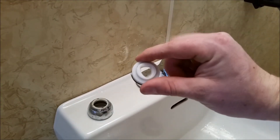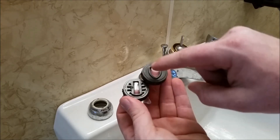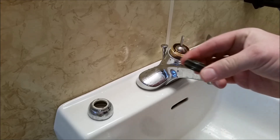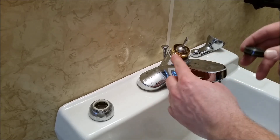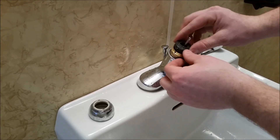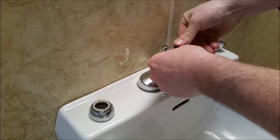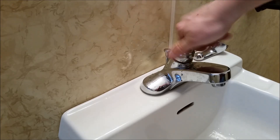So we're going to look at our old cover. You're going to see that this one is the triangle or V-shaped one — there's also a rectangle one. We're going to use the V-shaped one because that's what we had in there. You'll notice it has a little notch on the side here that's going to go in the notch of the faucet on the left, hot side. We'll just push that in, make sure the O-ring seats in there nice and well, push it in until it's all the way flush. Then we'll go ahead and grab the chrome cover and thread that back on by hand.